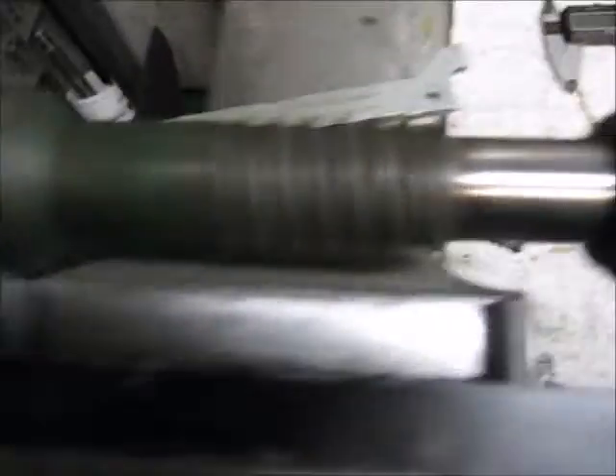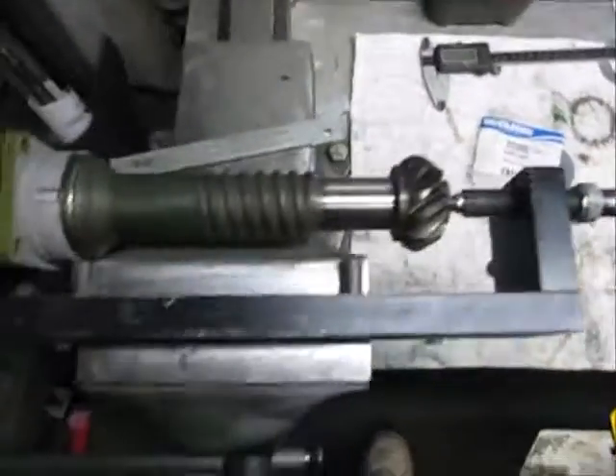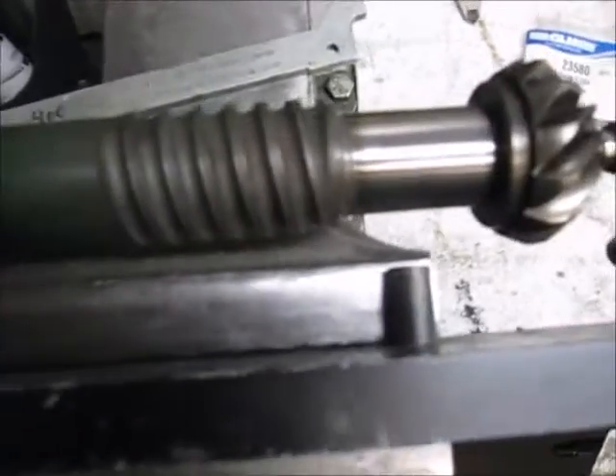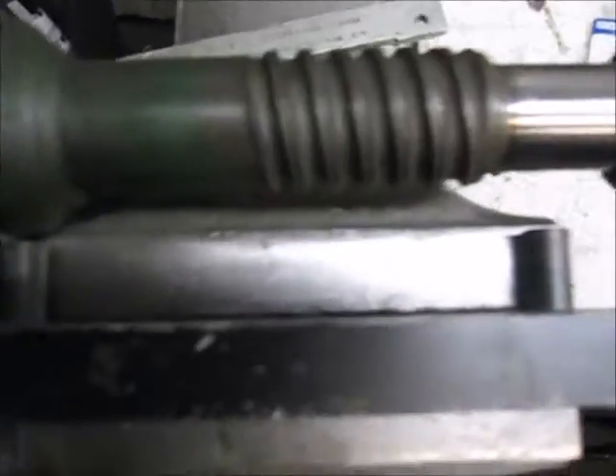For anyone who hasn't seen this, this is actually a shimming fixture. But you can make your own, or if you have a lathe you can place it on the lathe — anything that would basically put pressure on this to keep the whole assembly tight. What we want to do is push down with this bearing here and keep pressure on about six or eight pounds while we shim it.